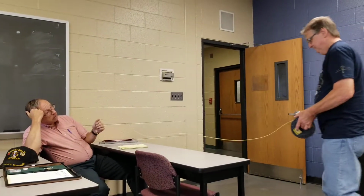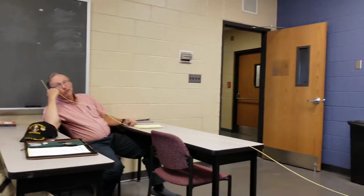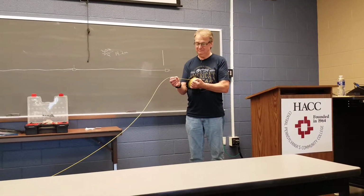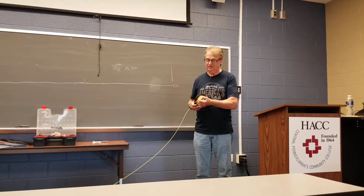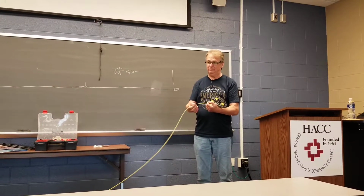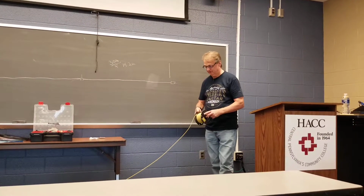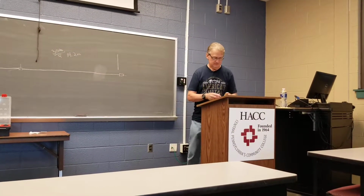We'll make a working antenna, and somebody gets to take it home. But this is THHN, and it's MTW, so this has a different velocity factor. Well, the velocity factor does figure in. Yes, it does. That's why you tune it. That's why you buy a radio with a tuner on it, then you don't have to worry about that stuff. So the skin on it, whatever that's made from, plastic, I don't know, is going to change the velocity factor. That velocity factor is the speed at which the antenna passes the radio wave. It's going to slow it down, so we'll leave enough wire to compensate for that.